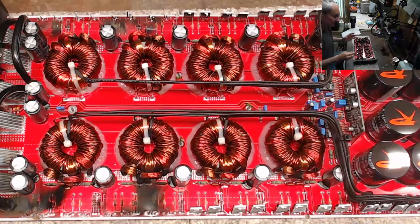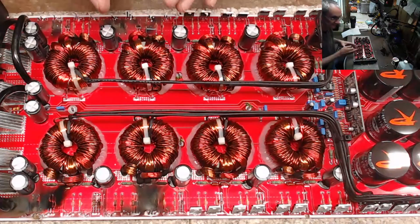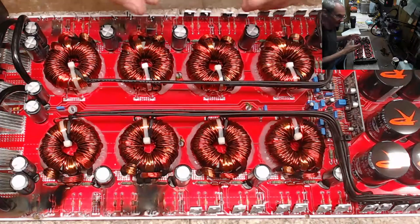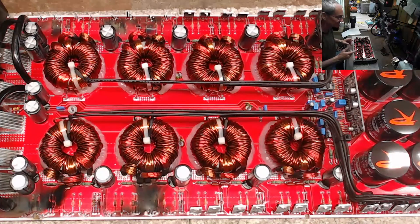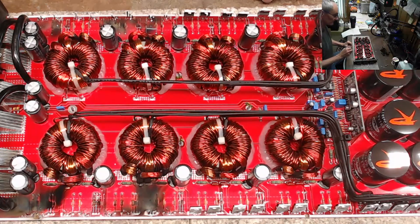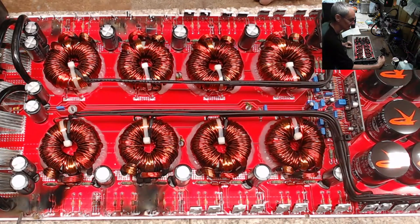The 1404 is a good transistor. I just wanted to go over this particular chain of events that caused this failure and what I look for when determining the steps needed to repair the amplifier. This amplifier failed directly from vibration damage — down here in the corner you can see these transistor legs are broke off flush at the board. This is a vibration damage board — these two legs broke off here, and this one right here, so this is drain, source, and source.